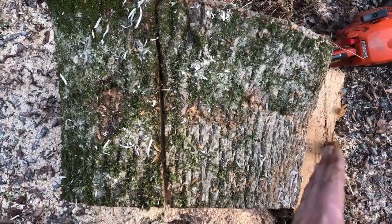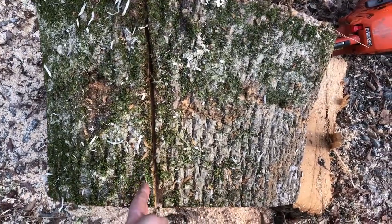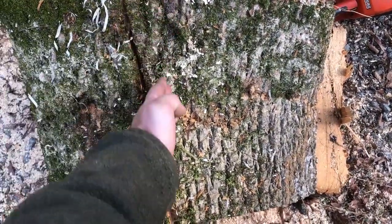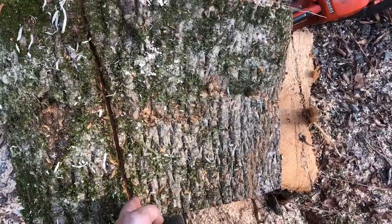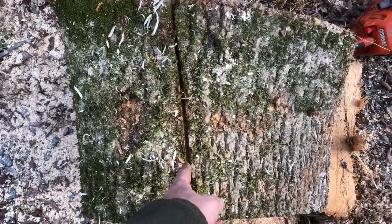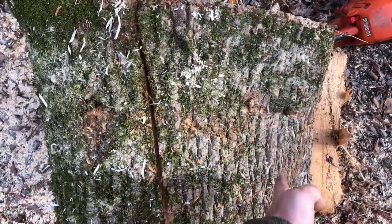If you have a section going off-angle and you mount it on the lathe as a natural edge, you're going to have to readjust — essentially make another cut parallel to it so you can bandsaw the blank more evenly, so it'll be truer and you lose less material from your diameter. So on this one I've got my pith line, I'm going to leave the natural edge there, make a slice here, then make another cut parallel to it and just do a finished-edge bowl on this side.